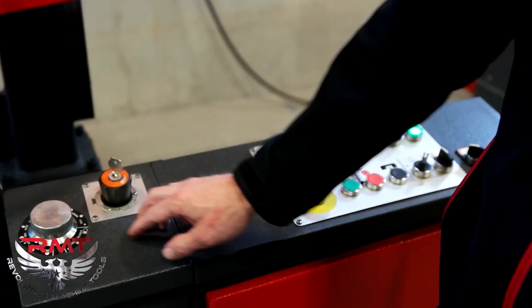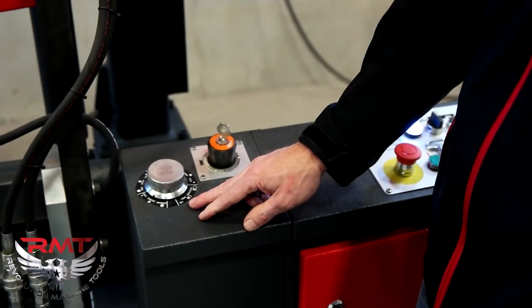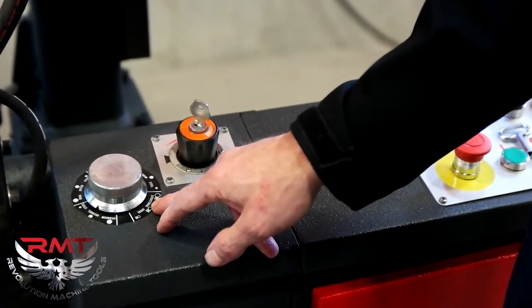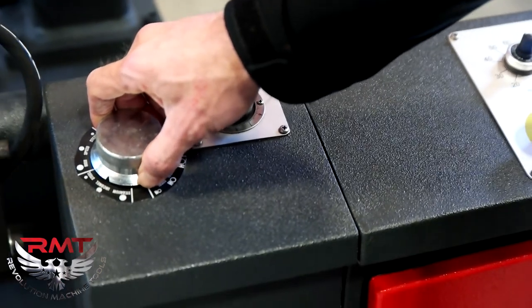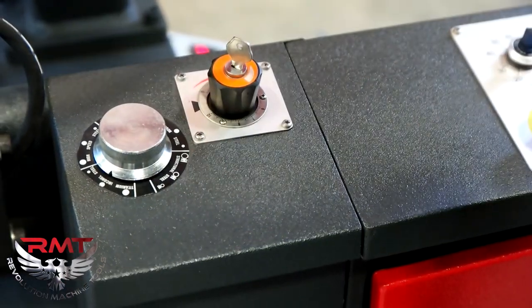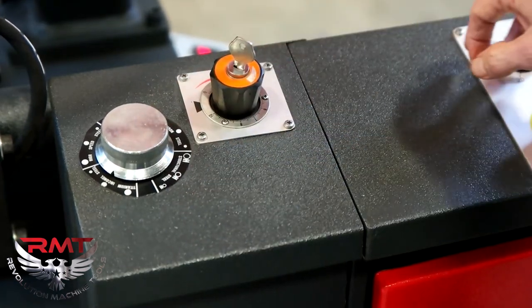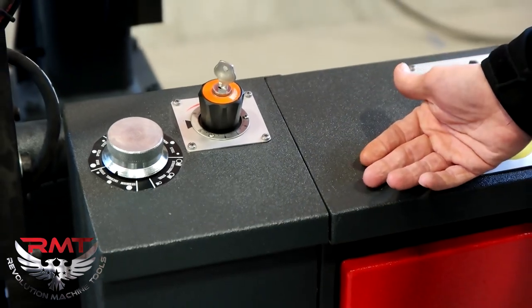Not to be confused with bow pressure — this dial shows everything from titanium down to mild steel and everything in between. You want to dial that in for how much hydraulic pressure is pushing on the cut. When you dial these three speeds in correctly, you'll get maximum efficiency and maximum blade life.